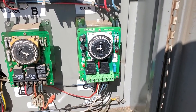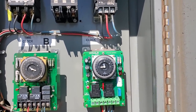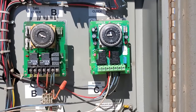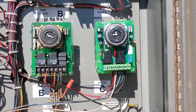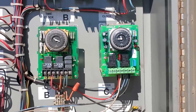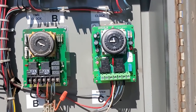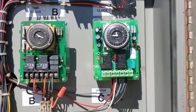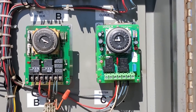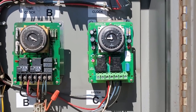I put in a new defrost clock too, because I figured I'm in here, I might as well — with all the work that I'm doing, I want a better defrost strategy. This is a test. There's a possibility that we could still have defrosting problems because they're only maintaining like 35, 36 degrees inside that box because they store bottles of beer, and we can't get below 32. We may set it for 34 or something. I also have to remember that this evaporator coil is a freezer coil, so the fin spacing is different, and that can affect the defrosting too. So we have to make sure we have a proper air defrost strategy. This is going to be a trial and error.